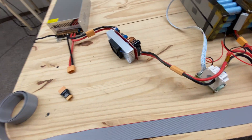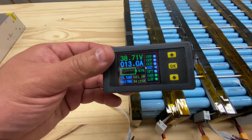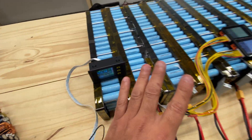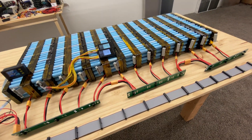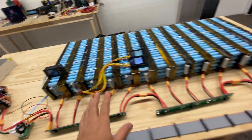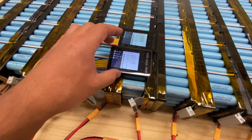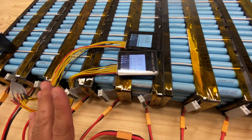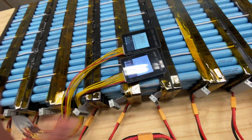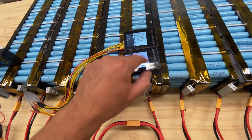I've made videos about this — I'll put them in the description. I'm using the little meter here, which is telling me it's charging at a rate of 500 watts. It's 38 volts, so 13 amps are going into these batteries. Once it reaches 42 volts, this thing will stop charging. After that I will check each individual pack to see how well the cell groups are balanced. If they're all around the same, then I'll connect this ribbon here, then connect these two to the ribbon.